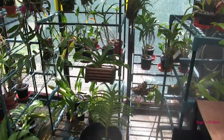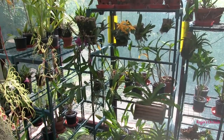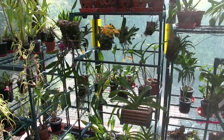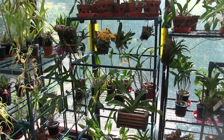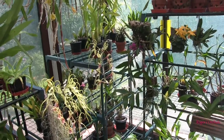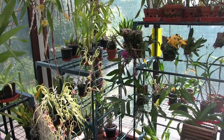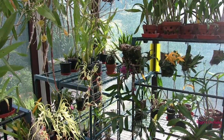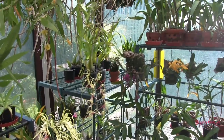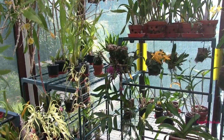A lot of Hurricane Hector's hard work is being negated by the inlet fan sucking air out — it's a catch-22. I'm getting 28 to 30 degrees in here and I'd rather that was 24 to 26 on a more regular basis. 26 is a perfectly adequate high — there's nothing in here that needs temperatures higher than that, and quite a bit in here that would prefer not to have it even as high as 26. The difference between 26 and 30 is quite dramatic — and we're talking centigrade, not Fahrenheit.